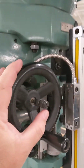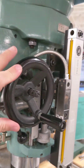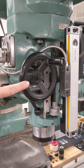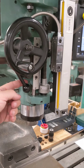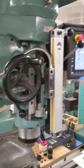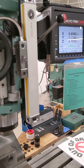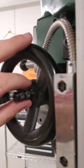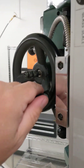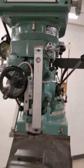I'm going to disengage it again and turn the spindle off. Now to switch the direction I'm going to pop this little button in all the way. When you run the spindle it runs the other direction, so if I were to engage the power feed it would be feeding the quill upwards instead of downwards.